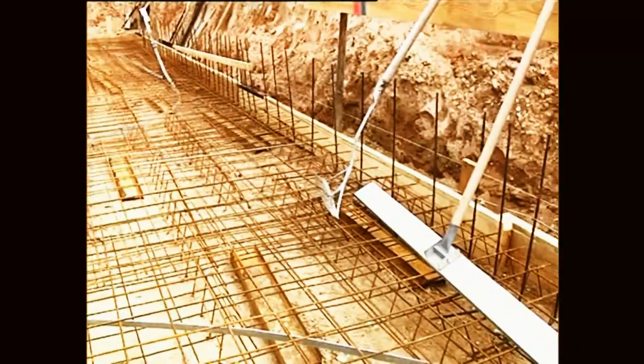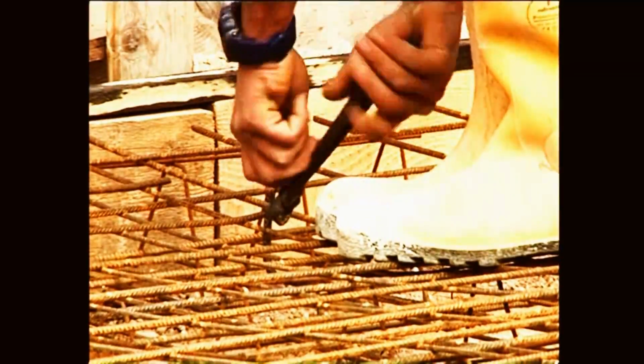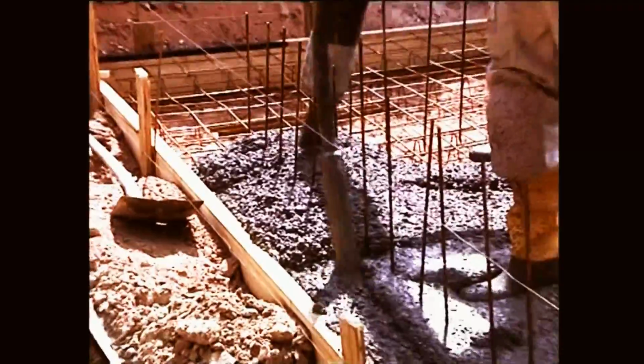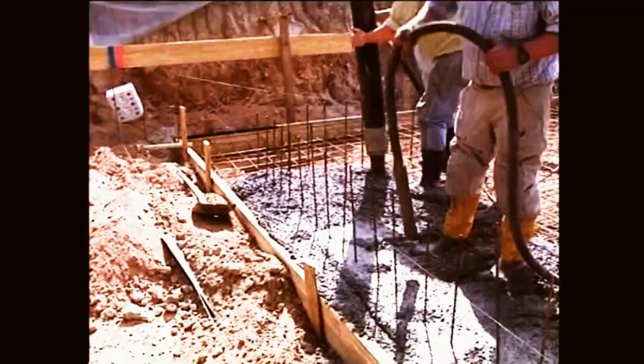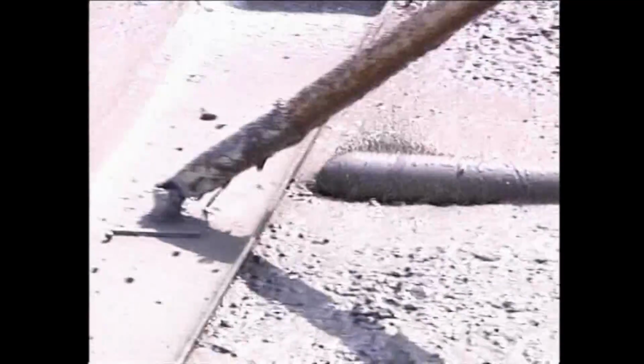After the excavation of the foundation trench, connecting steel bars are built into the base plate in accordance with structural engineering requirements by Argisol. The structural steel mesh is then filled with quality concrete. If required, a waterproof leveling layer should be applied.